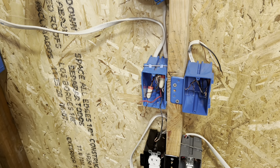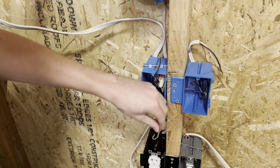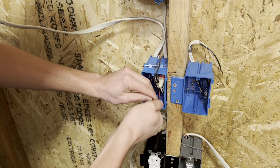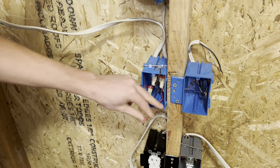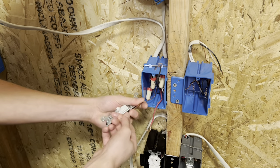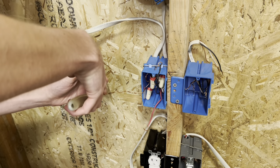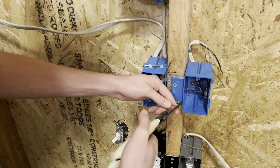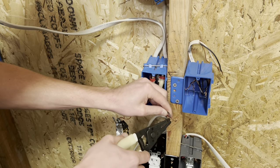Find your other side of the black traveler. This is the switch leg coming straight up from the right side. Go ahead and cut off your black wire, put a wire nut on it since it's not being used, make it 100% safe, and fold that back into the box. Now you are ready to put on your new single pole switch.